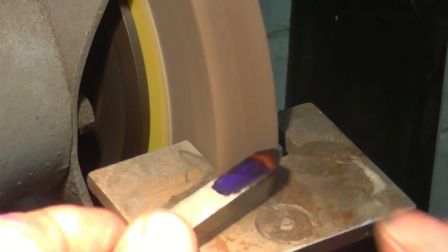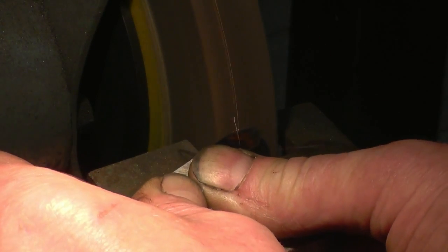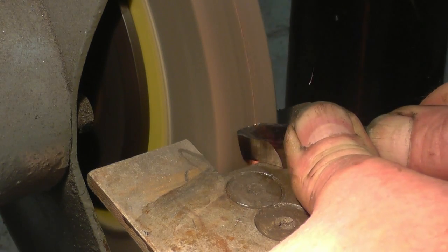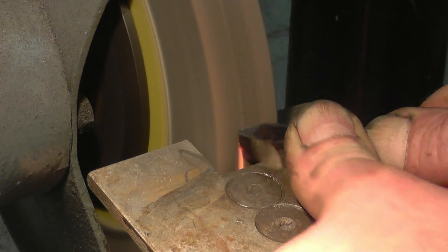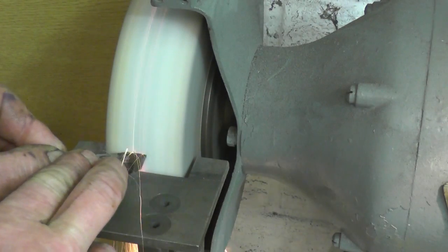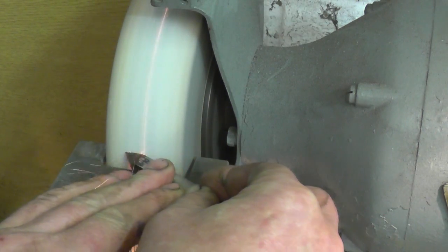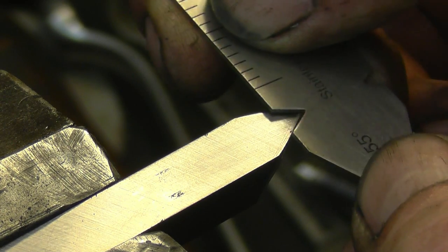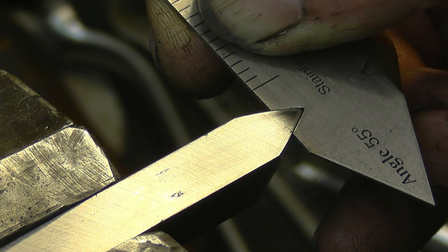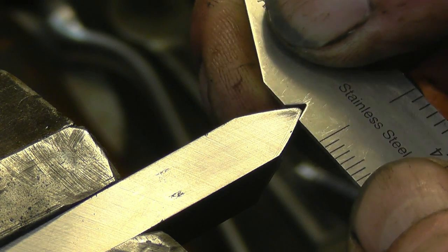You know when it's getting too hot when you can't touch it anymore. Now we've got our tool at 55 degrees. This is only a rough tool for our first few passes. Once we get the thread running near shape, I'll re-grind the tool. But that is it — 55 degrees.